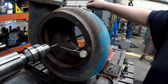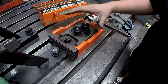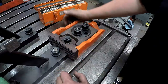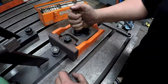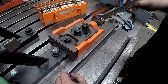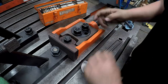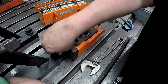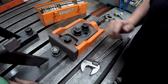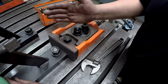Let me show you my little clamp — what I'm talking about here. This is the vise I'm talking about; this is the moving one. There's another one that looks just like it that is fixed, still up on the shelf. I've got this thing bolted down and I'm adjusting it — turning this is going to push this, push all that that way. I've got these pulled down tight and I'm using this to just barely tweak it so I can get the side-to-side indication close.